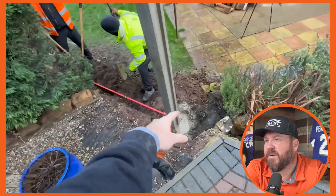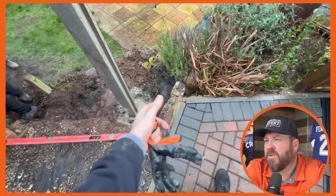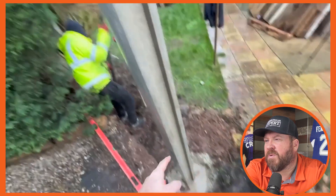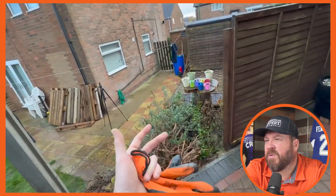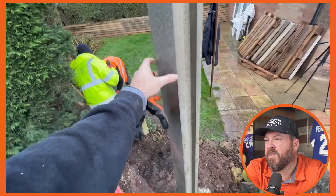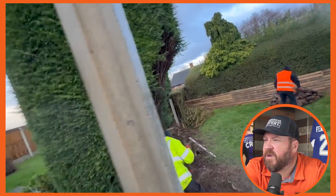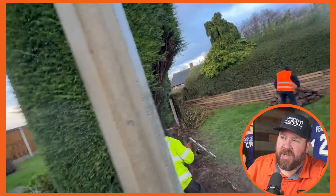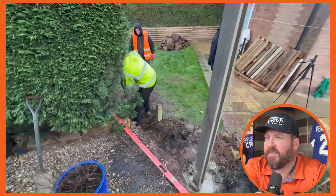Ten-foot post — dropped this in. There's going to be gravel boards running across here. There's going to be a couple gravel boards covering here to cover this gap. We've got six-foot gravel boards, and if we started here we would be too short over there. So we start here. Then we've got around about a six-foot give-or-take bay — custom panel anyway. Jamie can make it to whatever we need, so that's the beauty of that. We need to trim a little bit of this conifer, which is already done. This shows exactly what I'm talking about — it's got a channel in the post, so the posts are like an H post where the panel would slide in between. Concrete posts are obviously incredibly durable. The trade-off is they're going to be pretty heavy — that would be the one downside to this style — but longevity would be incredible.